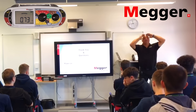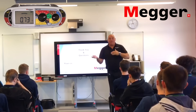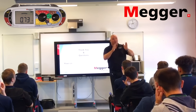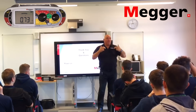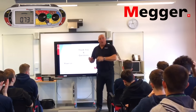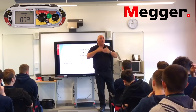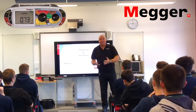Any questions? On calibrating — do you need to have it calibrated? Any test equipment: follow the manufacturer's instructions, which is to have it calibrated every 12 months. For me it's a no-brainer, because if something happens and you end up in a court of law, one of the questions they're going to ask is whether you had your meter calibrated. If you say no, you might as well light that match. So get it calibrated every 12 months. Even if you have a checkbox, get it done — there are lots of places, wholesalers, that hold calibration days at reasonable prices.